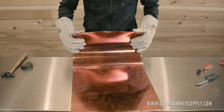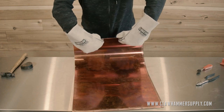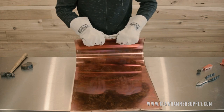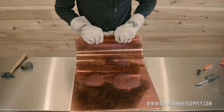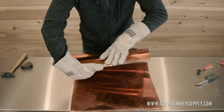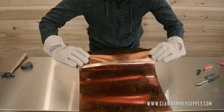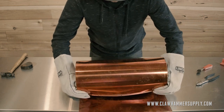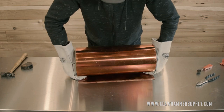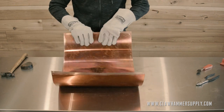What I'm doing here is rolling the boiler wall — the still boiler wall — over. We're starting with the flat piece and we're going to end up with the cylinder. You don't want to get too aggressive with this, because if you end up rolling too hard and you crease the copper, you're not going to be able to get that crease out. You'll still be able to build the still and it will still function, but you'll just notice that crease once it's finished.